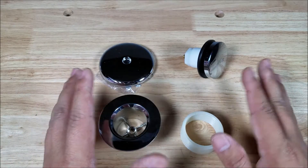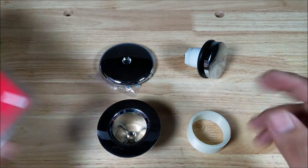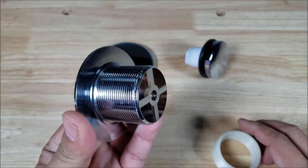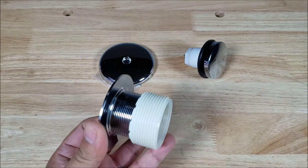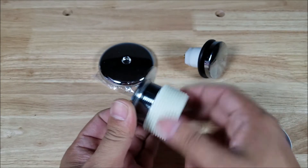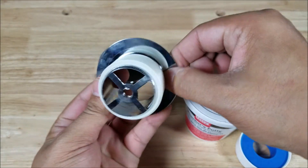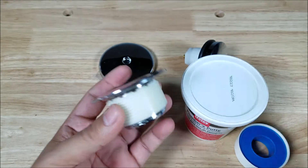Originally I wasn't going to mess with the bath shoe, but it was all crusty so I'm just replacing everything. This set comes in a package with the overflow plate, and the bath shoe fits from an inch and a half to an inch and seven-eighths — that's the smaller thread size. Mine is the bigger one, so I'm going to take this adapter and screw it all the way up tight, then wrap it with teflon tape maybe two times around to get a nice seal. Then I'll roll some plumber's putty into a little snake, tuck it right underneath the lip, and cinch it down so it spreads out the side.